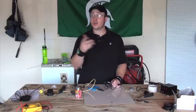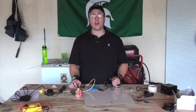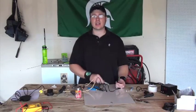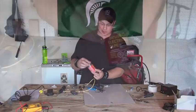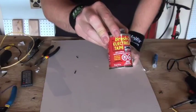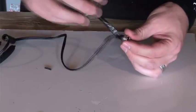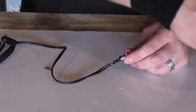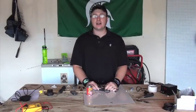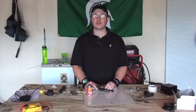One more step that I didn't show but applied when we did the DC plugs and the phone plugs and that sort of thing — I purchased this stuff called brush-on electrical tape. Really what this stuff is for is just like normal electrical tape, but in case you think that your circuits are getting a little too close, I just painted over each of these little spots to seal them away from each other so you don't have to worry about a short circuit.